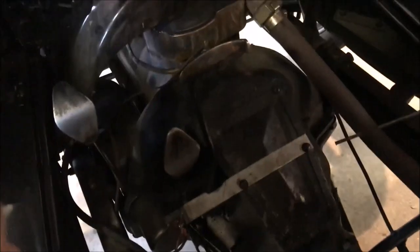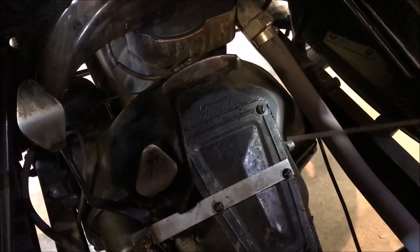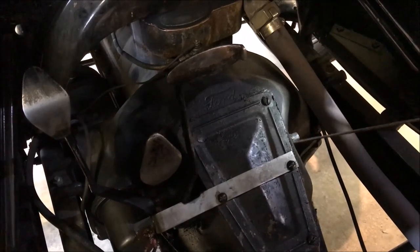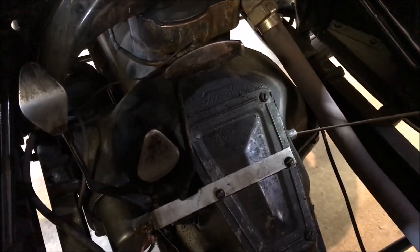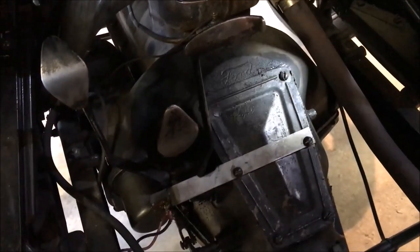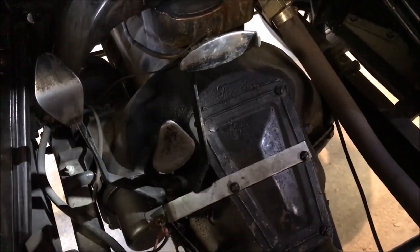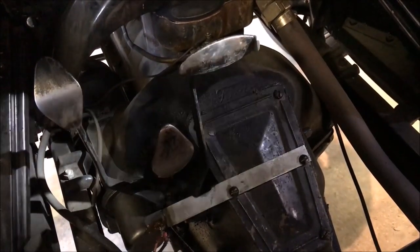The parking brakes. On the outside of the hog's head there's an adjustment for the low speed drum. You can loosen that nut, maybe give it a half a turn or a turn on the outside here and then tighten that back up. You'd do that whenever you feel that the pedal is maybe hitting the floorboards or the thing is slipping — if it's got too much pedal travel.